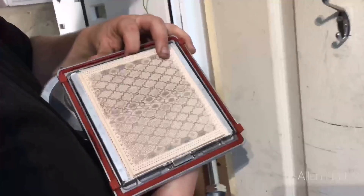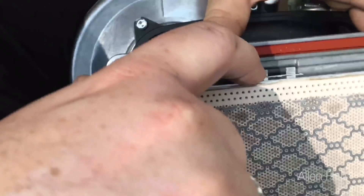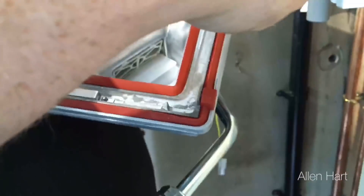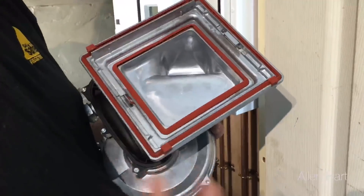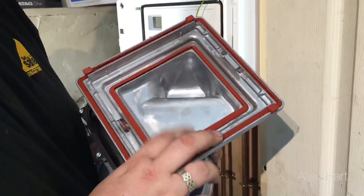You also need to check on the back. Remove this clip here with a flat head screwdriver to pry it out, then gently remove the ceramic burner. Check the burner seal and make sure it's in good condition. It's worth noting that when we remove these, the seals have to be replaced. This full strip down of the burner actually needs to be done every four years, or if the flue gas analysis is out. So every four years these seals need changing. If you just want to have a look in the heat exchanger you'll see the tubes.